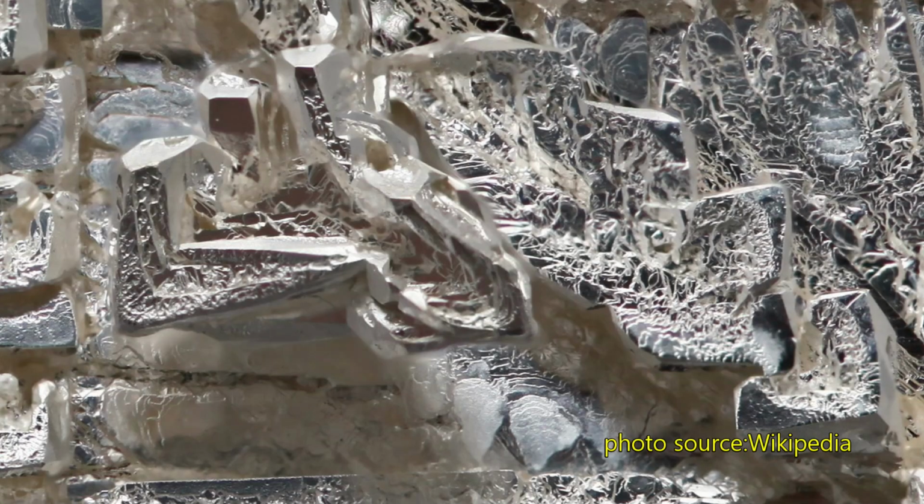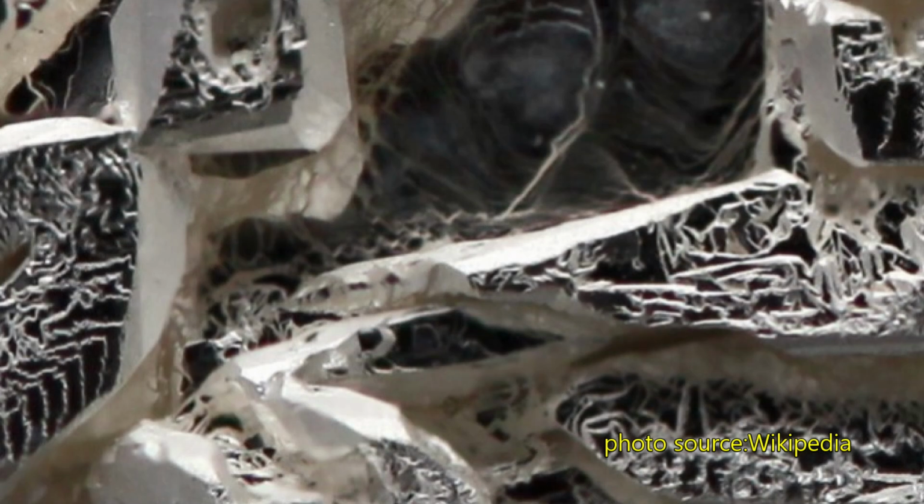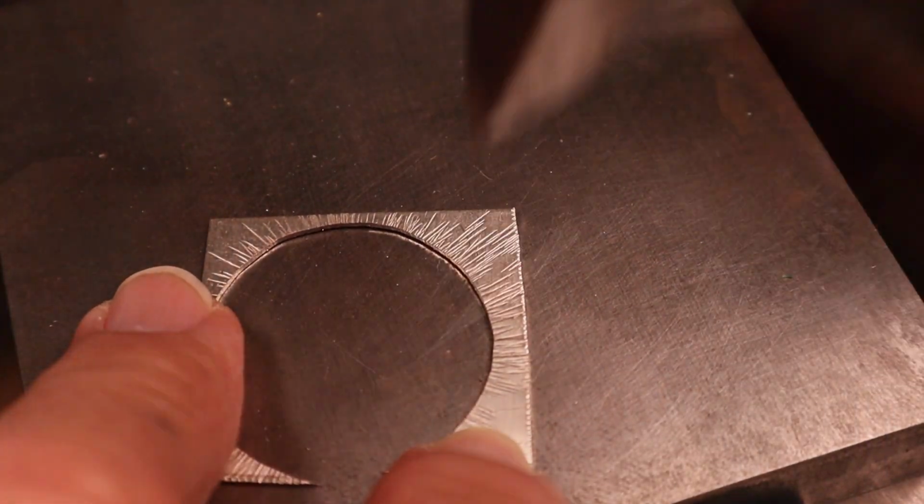To understand how annealing works, we have to zoom in and take a close look at the structure of metal. Let's use a silver wire for example. Silver is made up of a lattice or matrix of crystalline structures. These crystals are overlapping and intertwining together and are relaxed in their space, being relatively soft and malleable. However, we metalsmiths come along putting stresses on the silver by rolling it in a rolling mill, texturing and forging with a hammer.